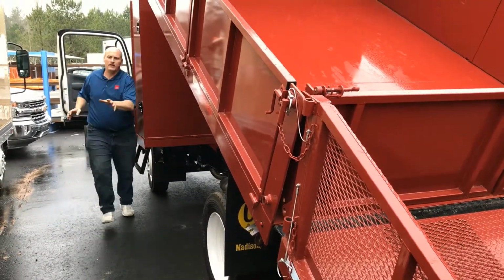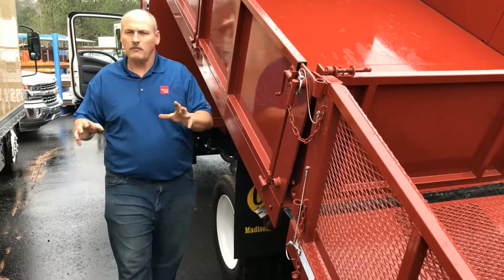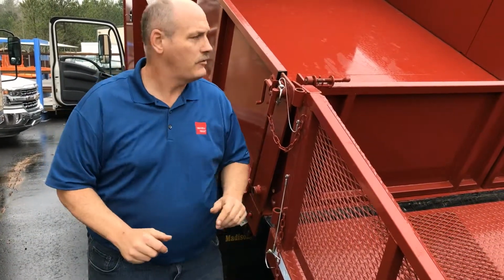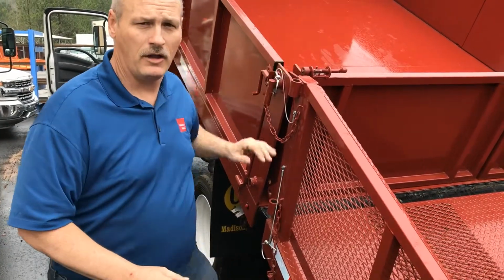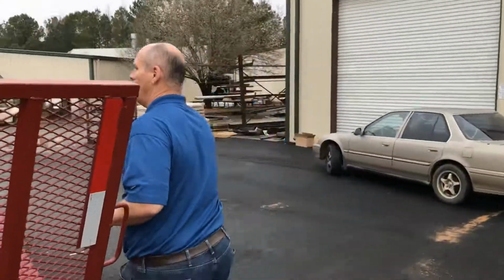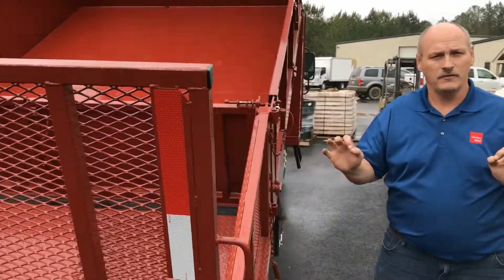Now, as you can tell, I made sure that the vehicle rolled forward about 6 inches. The rest of this is lowering down to put down the safety pin. I'm rechecking my dog tags just to make sure, because I'm doing this solo. You may have a crew with you, you may be solo. And again, on both sides, we're safe and secure.